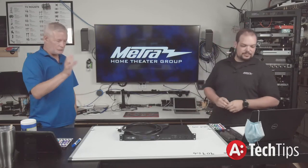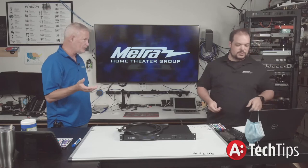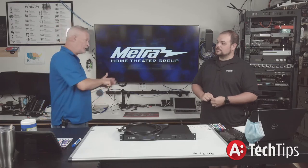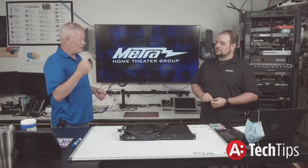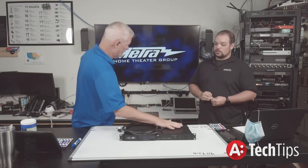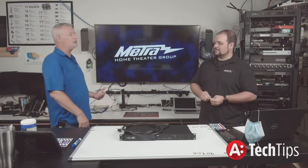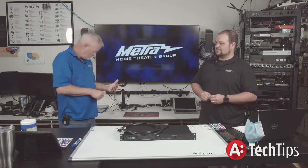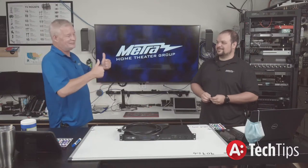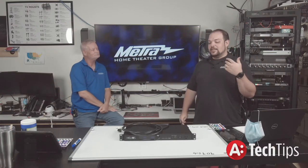What doesn't go into the controlled outlets is the router or any networking equipment that's between this device and the outside world. If you have a POE switch powering surveillance cameras and wifi access, so long as this unit still has a wifi connection, any network device after it can be rebooted — that's fine. But anything between this and the outside — switches it's connected to, the wifi it's connected to, any routers or modems — you don't want those on the smart outlets. You can plug those into the four switched outlets physically controlled by the power switch on the front, because at that point you're making the conscious decision to reset them and someone is physically there to do so.